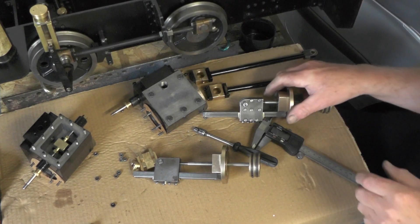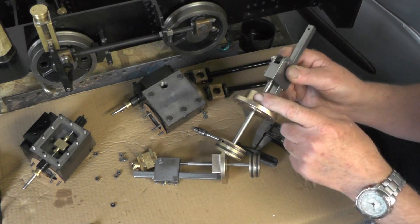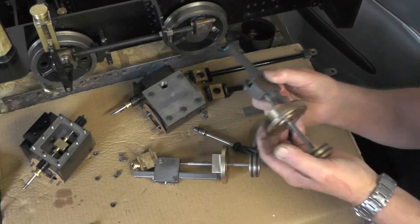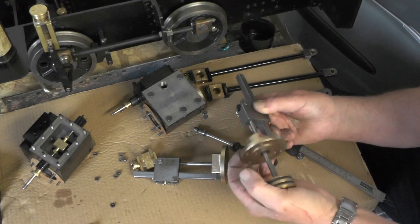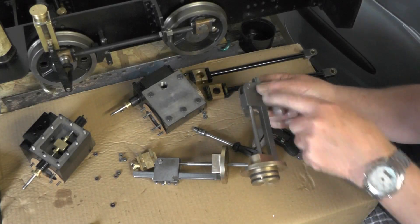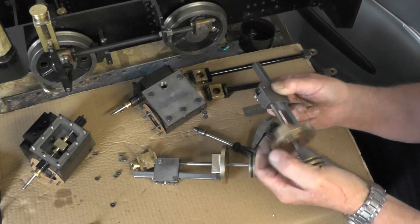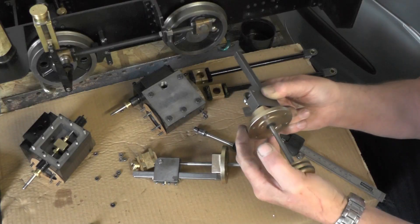I'll bring the camera over here and show you what I mean. This one is correct — once you've got the cover bolted to the slide bar and the cross head fitted with your piston in, this is what you need to check before you fit it to the loco. You need to make sure you've got full movement with no binding for the piston rod when it runs in the slide bar on the cross head. It's a good job I checked it because I've got this one wrong. That's how it wants to be — a nice fit but with no binding.